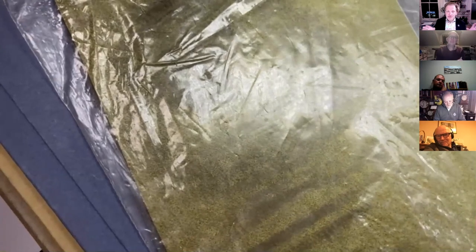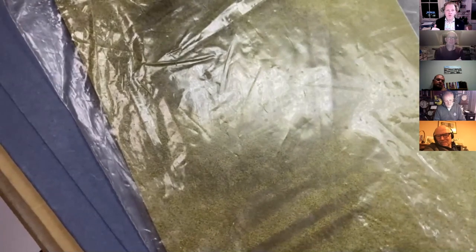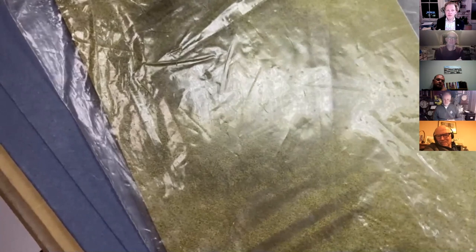New making is very, very different in my book from working with historic objects. The kinds of clocks that I typically have lying about, some parts of them might have been polished when they were new, but they had filed or scraped finishes, draw filed, that kind of thing. So there's very, very little use in my practice for abrasive paper, because one of the foundation stones of clock making is sharp angular detail, and it's ever so easy to lose that.